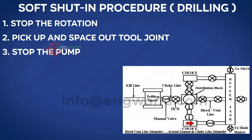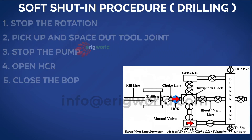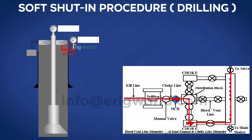To prevent the pulse from going downhole, we first open the surface line. The closed element is the HCR, so we open the HCR first. The well then starts flowing on surface — through the annulus and through the choke manifold. Now we close the BOP. When the BOP is closed, the pulse is generated, but because the choke was already open, the pulse travels to surface rather than downhole. The formation is protected from that surge pressure.